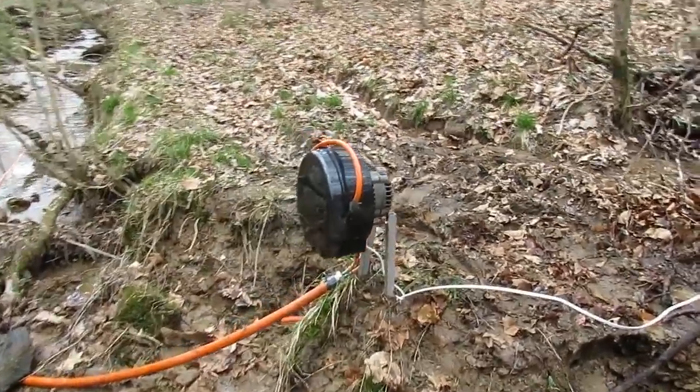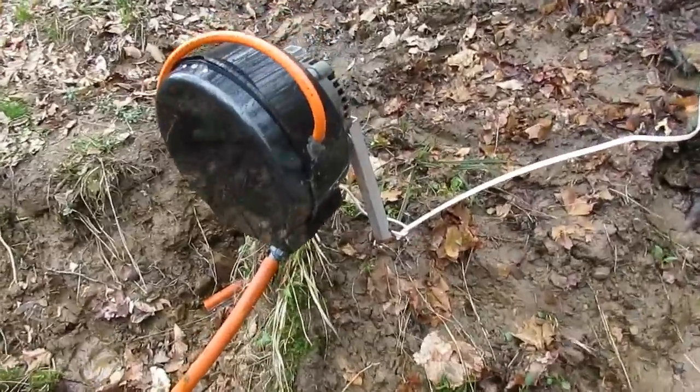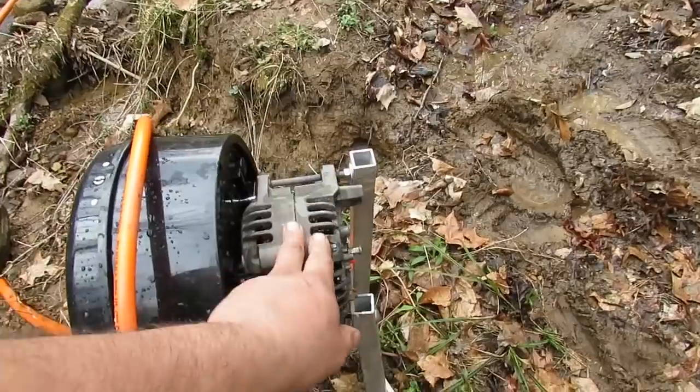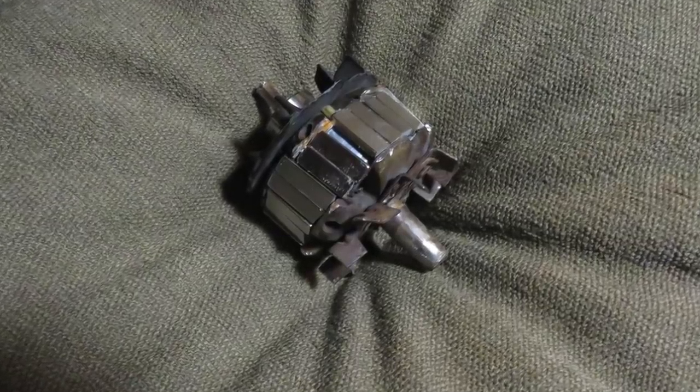I have my water turbine actually making power — I turned it off so I can show you. You remember the alternator I had converted to a PMA? It's still a PMA, but I took it apart and put rectangular magnets all the way around. The square magnets fit in a lot neater and fill up pretty much the whole space. I put them alternating north-south, and there are now 24 magnets around that rotor instead of 12, so the field changes twice as often as the north and south poles pass over the coils.